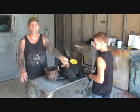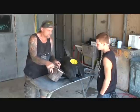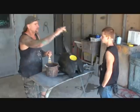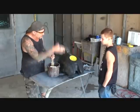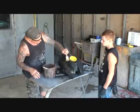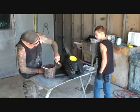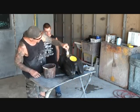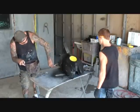Take your brush — this is a throwaway two-inch brush. Look at the way that stripper's acting. If you look down inside here, you can see the stripper starting to bubble, which means it's already reacting and working. Make sure you have your safety glasses on. When you apply stripper, you don't want to go back and forth — the more you move it around, the less activated it is. Just do a one-stroke deal. That's how you apply it. If you watch close, you can see it bubbling up and starting to eat the paint.